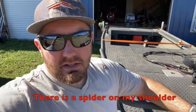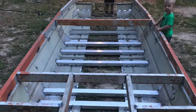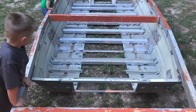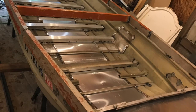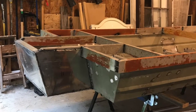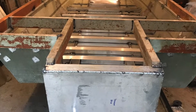I took out all the ribs, ground it out, and drilled out all the rivets. Then I started welding some other stuff in. Where this boat used to be a riveted boat, it's now an all-welded boat. I welded some cross braces on it, then came back and put a skin right down the middle. I built a motor pod out the back — it allows the motor to sit back and it's not right there in the boat, so it makes the boat a little longer.